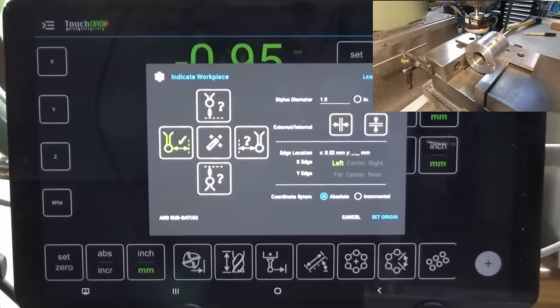And then I ran the probe back in and I kept probing that edge and then checking the result. And I reckon I've got it to within less than 10 microns. So it is accurate. I sort of doubted it before. I was doubting my results, but having done that test again, I'm pretty sure I've got it right. Now you're going to see more of that touch probe in future videos, and in fact in the next video we're back working on the Stuart Turner 10H engine, so join me for that one.